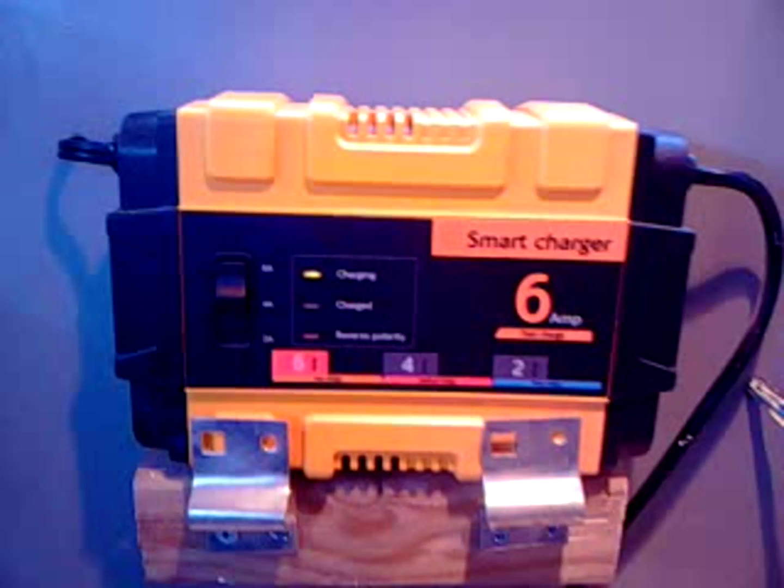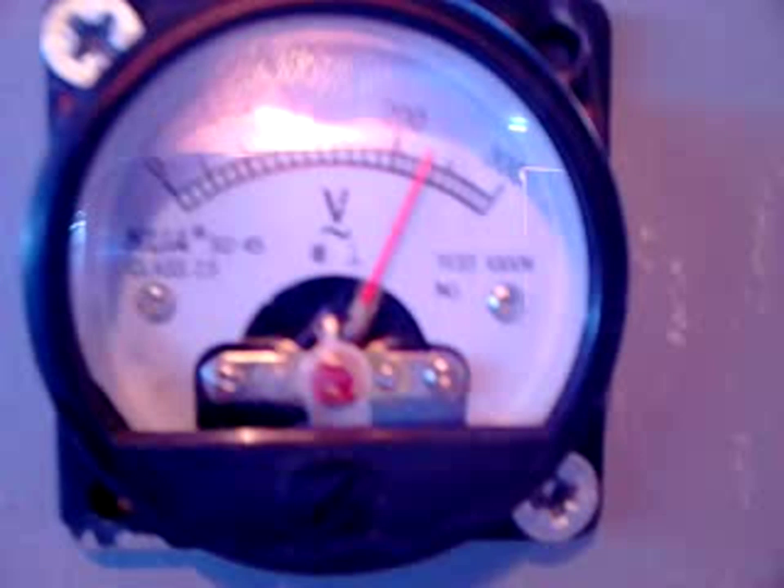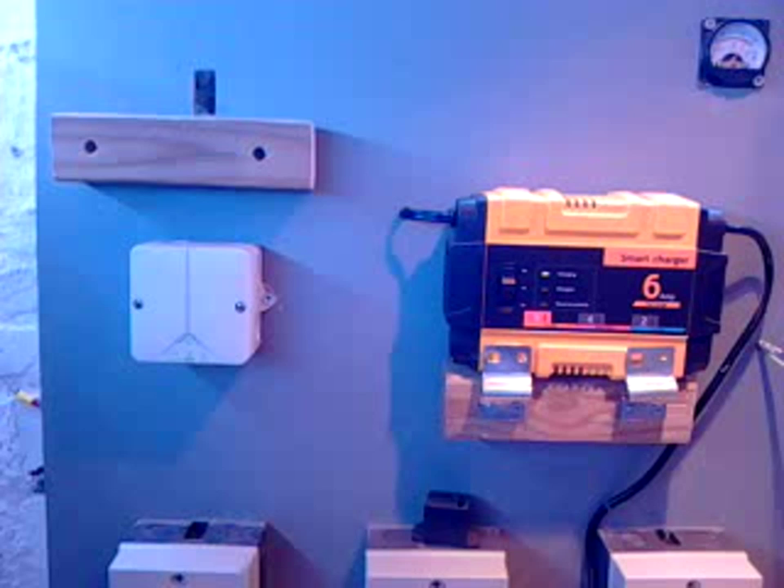Here's a 3.2-kilowatt generator with a built-in battery charger. Solar power today was about 0.2 amps — it's not sunny at all. Generator output is 230 volts and battery voltage is 14.2, which tells me the battery is full. I'm going to get another battery charger — identical — so I'll have about 14 amps off this charger, then 10 amps off the generator's built-in charger: about 24 amps in total charging the battery. That's pretty good — about 280 to 300 watts.